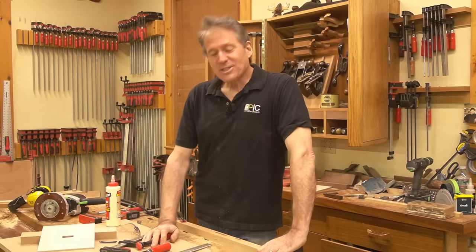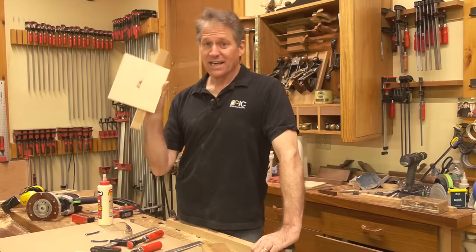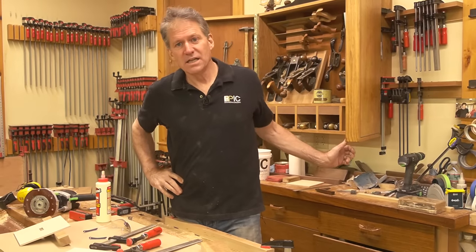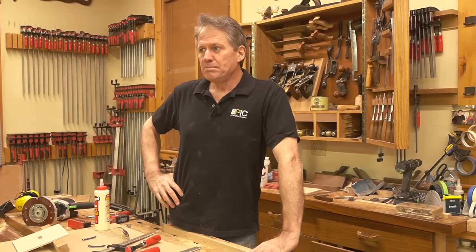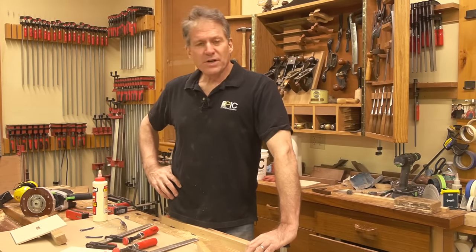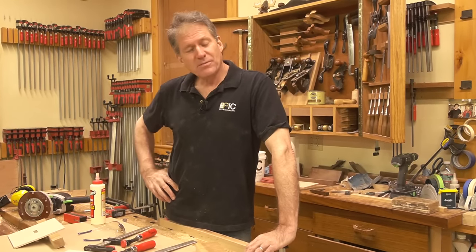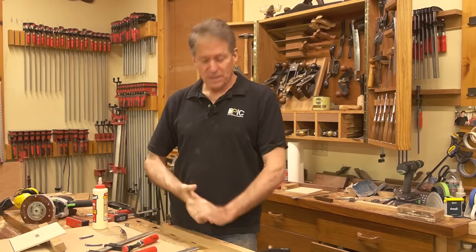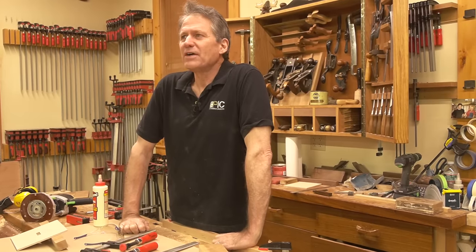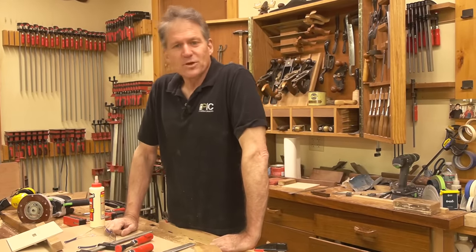That's a crash course in using your router for plunge-cutting mortises in two different ways: a fence and the guide collar system. Many options for this method. Tony asks: could you use a router fence on both sides? I'm not sure if you can put another fence on the router, but I double-stick tape a piece on the other side — there probably are routers that have double fences. I think there actually is an attachment for the Festool, or maybe for the Domino. There's a type of guide that hits both sides, but not for the router.